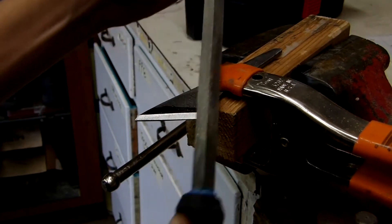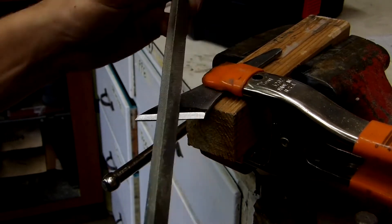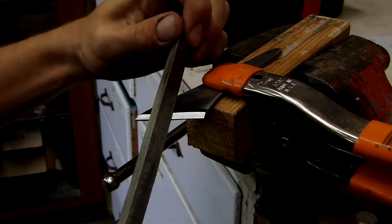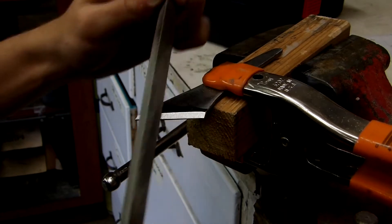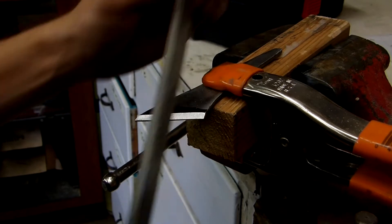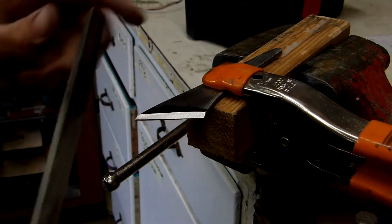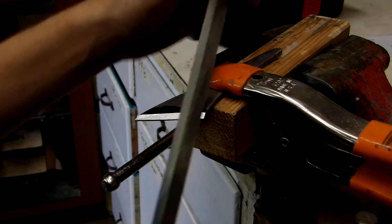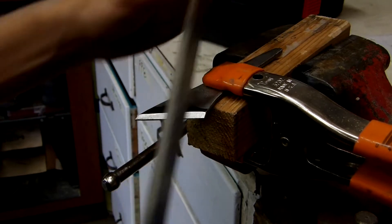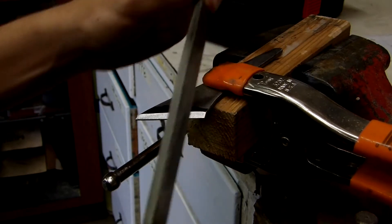Unless you have an angled jig for grinding, or want to keep practicing on scrap material, I would recommend just doing a lot of hand filing. It's also great practice because as you get more in-depth with stuff, there's going to be a lot you just have to file — there's no power tool for it. And even if there is, you may not have access to it. One of the tricks I've learned: rather than going up and down section by section, you want to run diagonally.